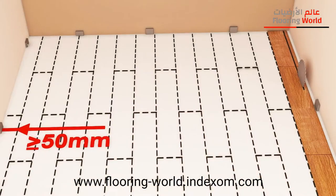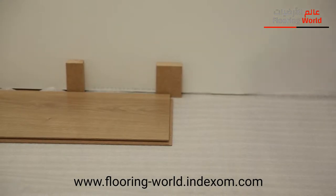Also, in cases where the wall is the full length of the flooring, the tips of the parquet must be double cut and installed appropriate to the wall length. Both ends of the flooring need to be at the same distance to the wall. Start the installation from the left corner of the area to be applied.